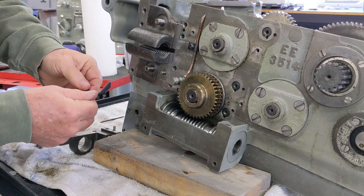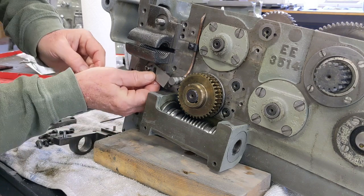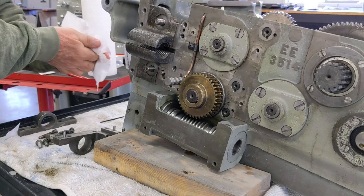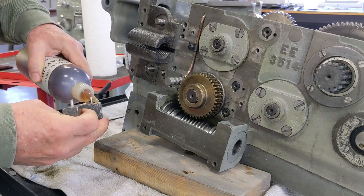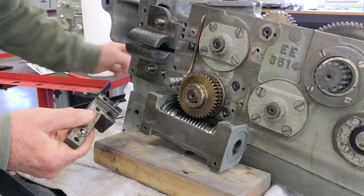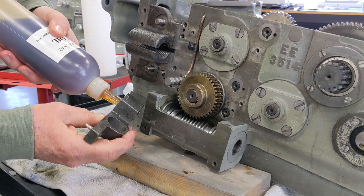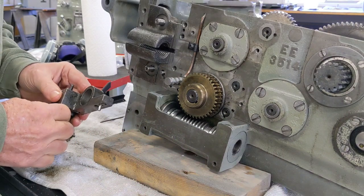I can see a little mark right here, so that tells me that this guy goes right here. I'll push it in and lock it in — that should hold it in place. Now I'll get some lube in here. There's also an Allen screw right here and what appears to be a plunger in there. There are these little detents here, so I'm quite sure that plunger has a spring in there. I did not take that apart, so let's just make sure that plunger is free. It works great.